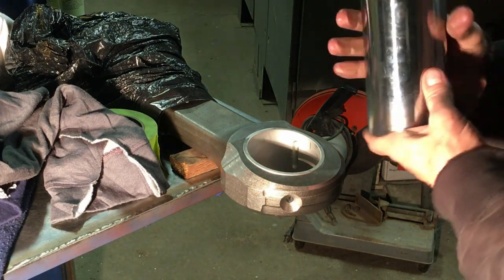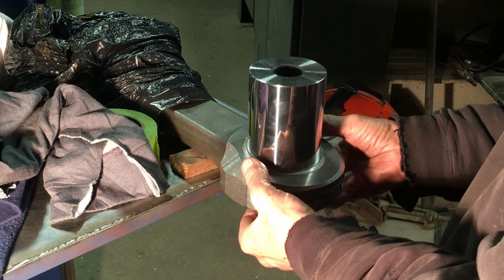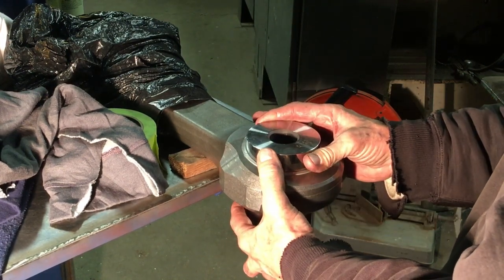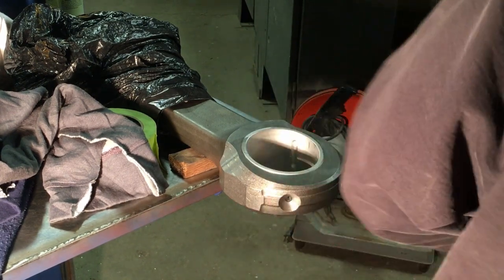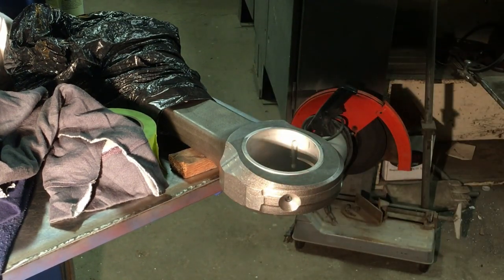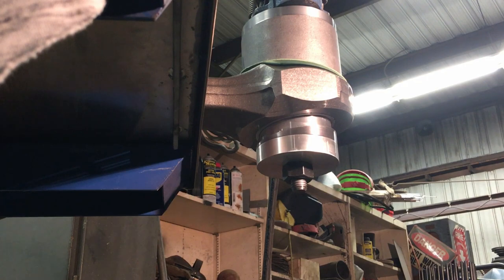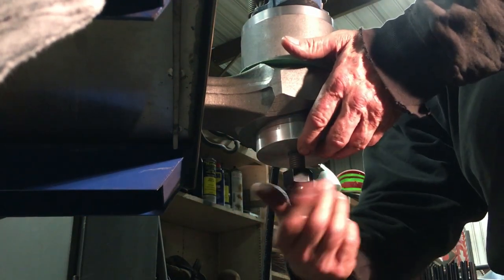As I mentioned earlier, the bushings are designed to press in and have the clearance built right in them. On these particular rods, they're running about a 3/1000 clearance fit. You will also notice these bushings are splash fed oil only. This was the second one out of 16. Only 14 more to go.